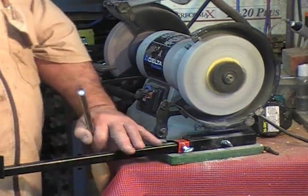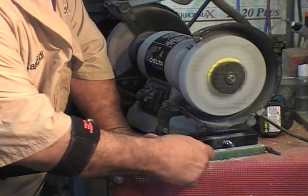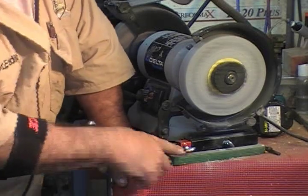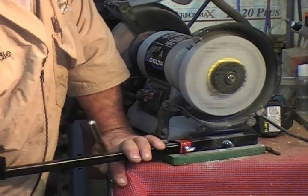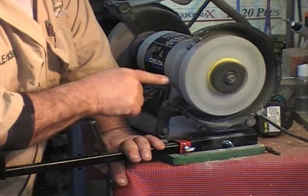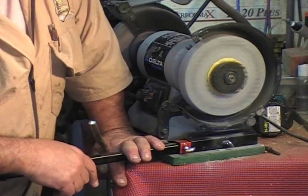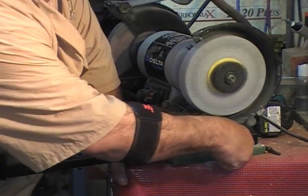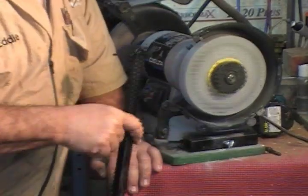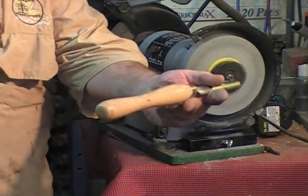Can you imagine how much longer your tools will last? I just fell off the Sorby's Christmas list forever. Now, I pushed AccuSet up and tightened it down. The only time I'm going to have to worry about that is if I dress this wheel a lot — and I mean a lot. So now we have set this one, it is done. This piece can go hang on the shelf next to the tool, and when you want to sharpen that gouge, it's ready.